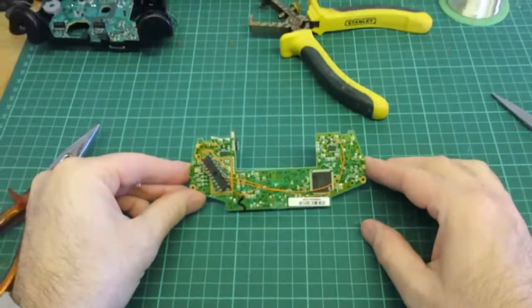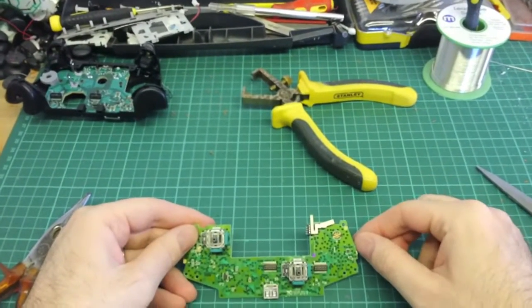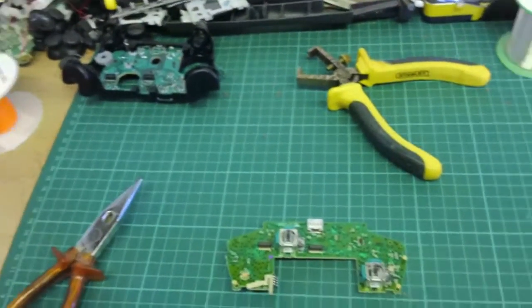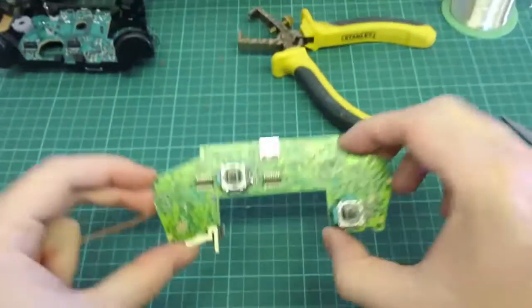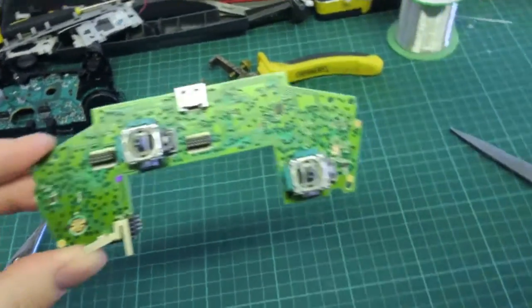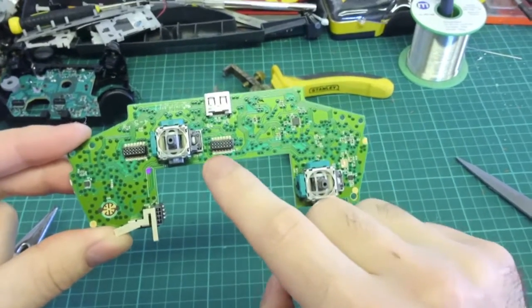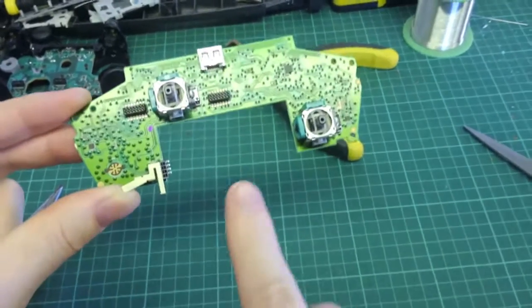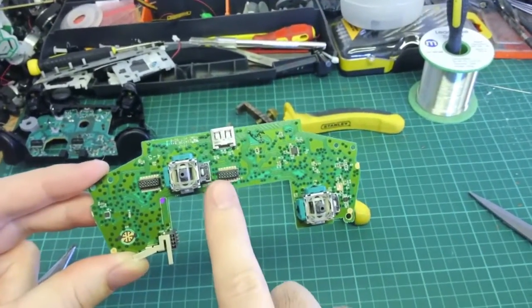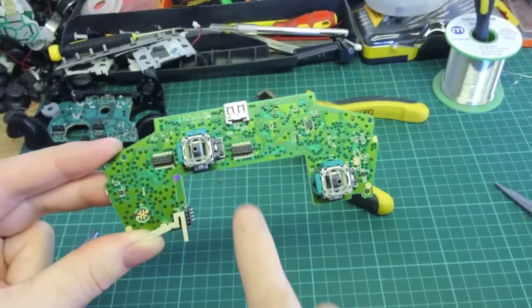That's all the connections on the back of the PCB. Now I'm going to flip the PCB over and start our connections on the front. I like to start with the top of this middle connector. These connections are quite small so take care — try not to bridge them. If you do it's not the end of the world; our guide shows how to unsolder a bridge. Strip about 2-3mm of wire and come in from the bottom — don't come in sideways, go straight on and draw away, otherwise you'll end up bridging connections.